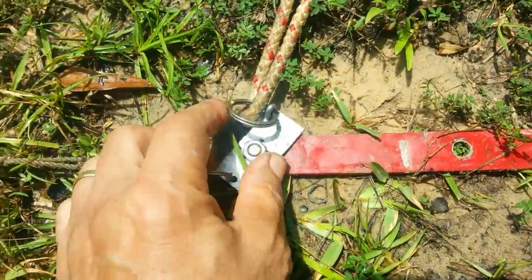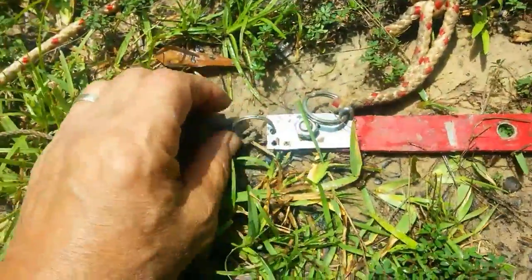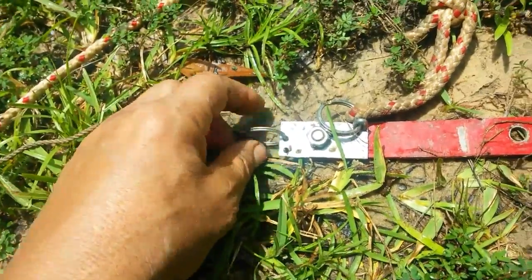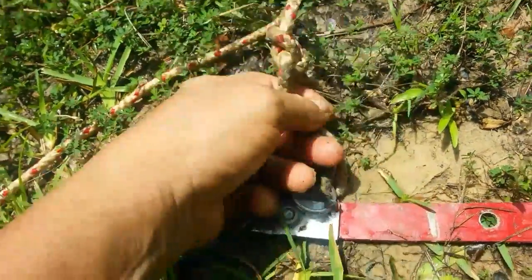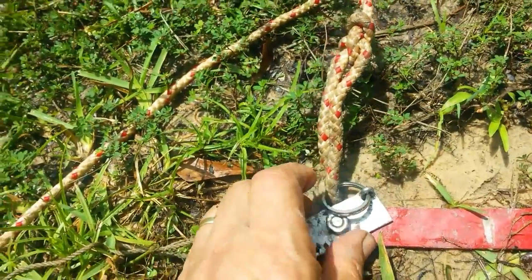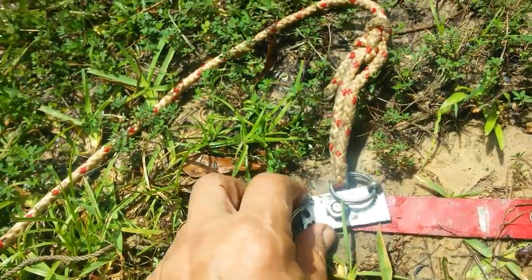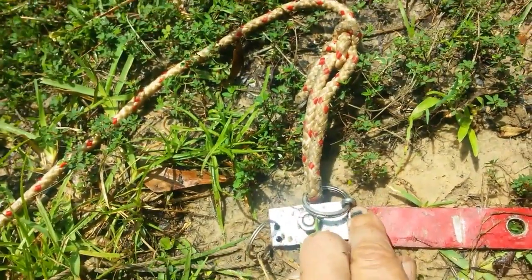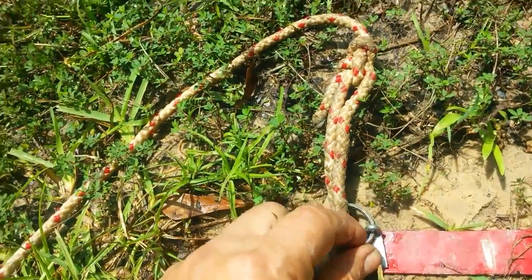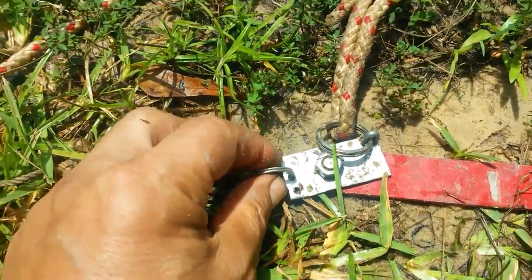This hole is three eighths. At the very top, drill a small drop line hole. Over here on the corner that does all the work, this corner digs into the side of the pipe. This one digs onto the other side and pushes this one into the pipe to lock it in place. This little hole is about one eighth inch — it's one quarter up and one eighth from the side. And this one is one eighth down and centered.